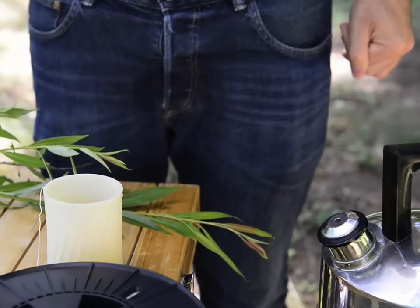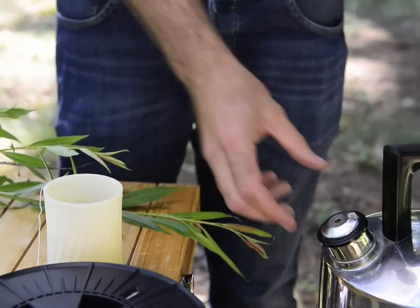Willow Flex is made from compostable raw materials, certified in both the EU and the US. The filament is printable at 175 Celsius at a rate of 60 millimeters per second. And because it's made from natural materials, it has different qualities than other plastics. For instance, it's heat resistant above 100 degrees centigrade, which makes it perfect for your next cup of tea.